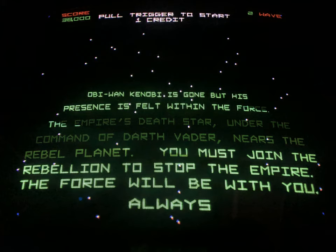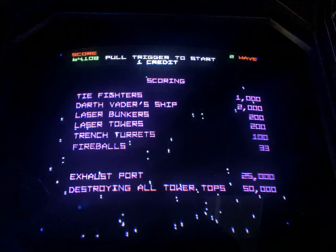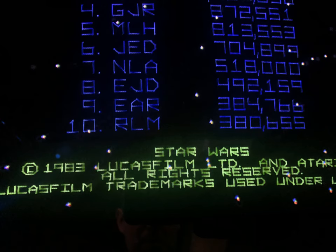So the original Amplifone tube that was in here was just so dark and dim and dull. And you'll see here towards the end of the pictures, you'll see for yourself how bad it was. And yeah, if you watched the video prior to this one, you'll see also in a video form really how bad it was as well. I forgot to get some before pictures, but it was hard to play the game because the blue was dead, and I had to have it so bright in order to even see any of the image that it was blurry, and it just had to be changed out.